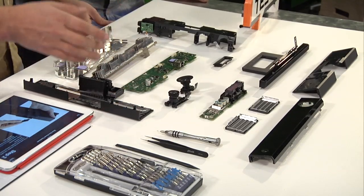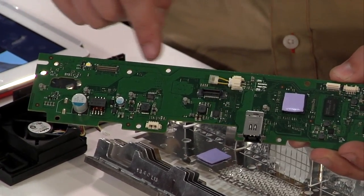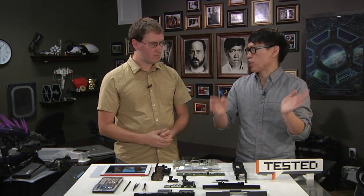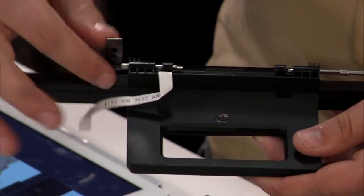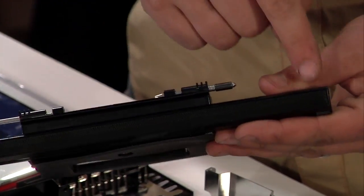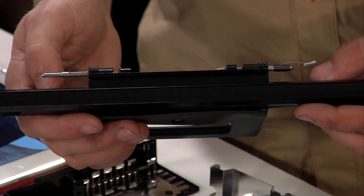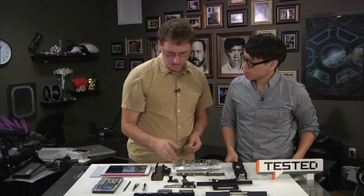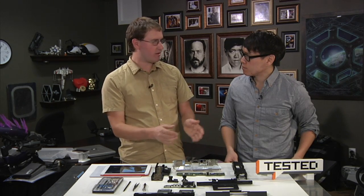The circuit board has a fair amount of empty space — they could have made it smaller, but they needed the spacing so the microphones would be separated from each other. That's how you get stereo, directional positioning of people in the room. The microphones are embedded in the base of the unit, with a ribbon cable bringing the leads out. The requirement to have microphones at a certain distance apart is likely what defines the overall shape of the Kinect.